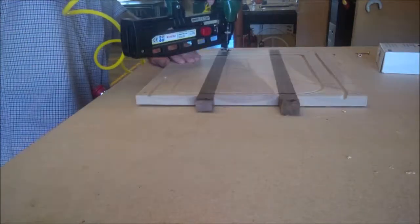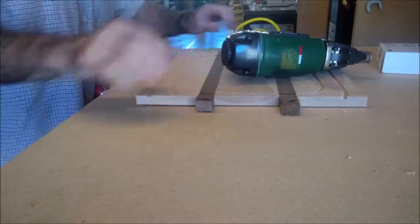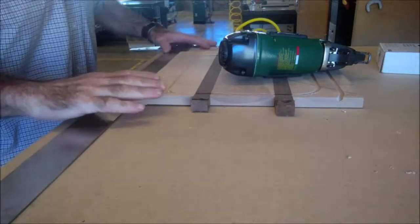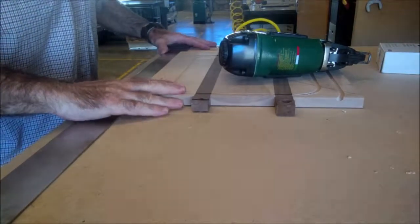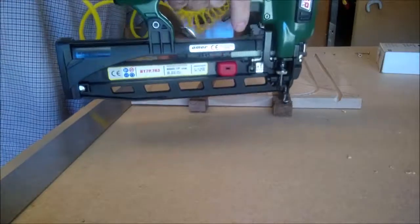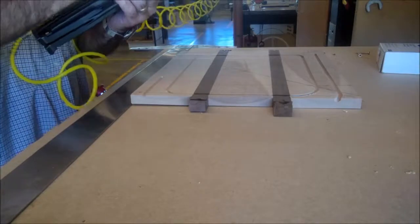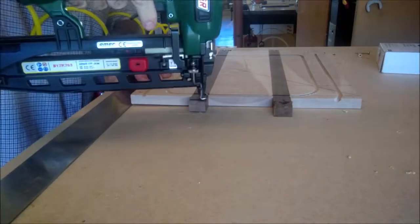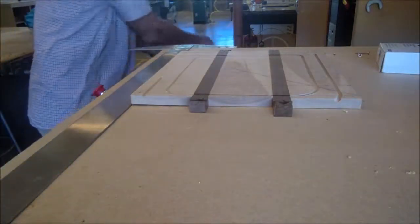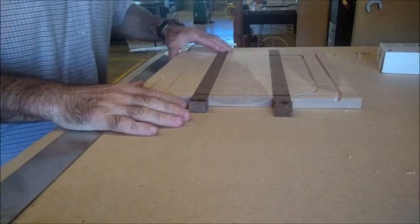There are those nails to the side — that's recessed a little bit. I just put one nail in first, then I use my square. Put that square up there, pull it up to the square, put a second nail in. Let me adjust that a little bit. Oh man, that is solid. That thing is solid down. I like that.